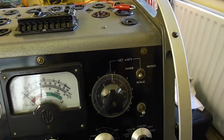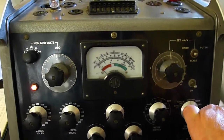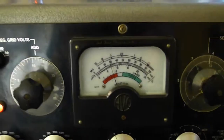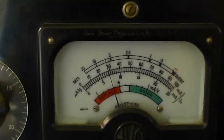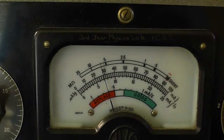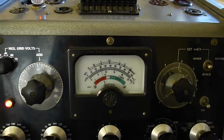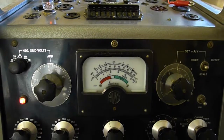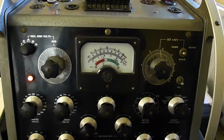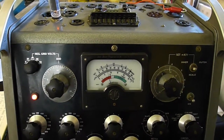And 11.3 milliamps per volt on there. So I can test it now, see how many milliamps we get. So I'll turn it on. And not great — you can see it's down to below 30 milliamps. It should be 48. I know this meter works, for a new good quality valve it will give you 48 milliamps at the right setting.